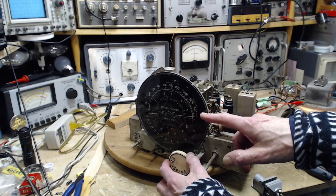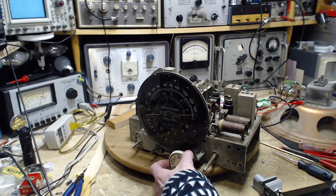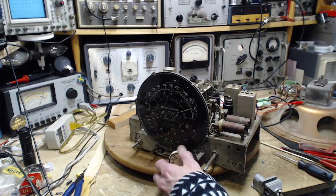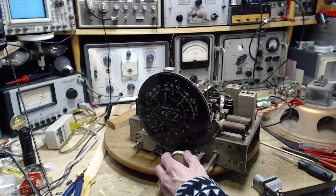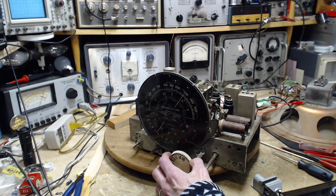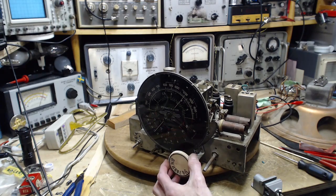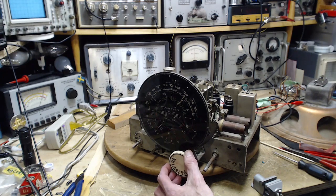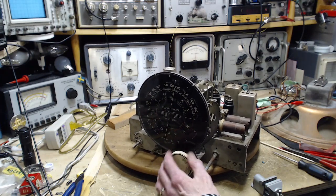It's gone silent, more silent up here, but I think there still is an oscillation. It's an oscillation on a band that's seldom used. Okay, so we'll do the alignment at 4 megahertz instead. There's much noise there. Let's do it in the middle.